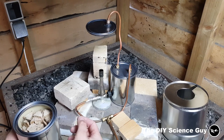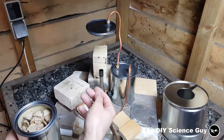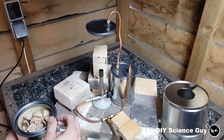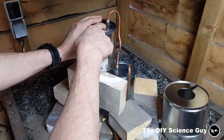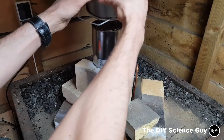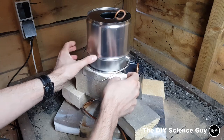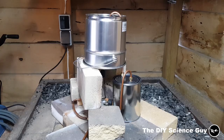This is also a process that could get very much out of hand, because there's no control on how much wood gas is being produced — more gas means bigger fire means more gas and a bigger fire. So in case that happens, I will just put out the flame, but let's first see if it will work. These pipe connections I just glued in with some heat-resistant coating with a quarter inch nut on the other side. Then I put on this steel bucket with a hole in it, with some room for the hose to contain the flame a bit better so not all the heat goes around it. Let's light it up and see how it goes — I'm doing this in my forge, because where else should I light a fire?